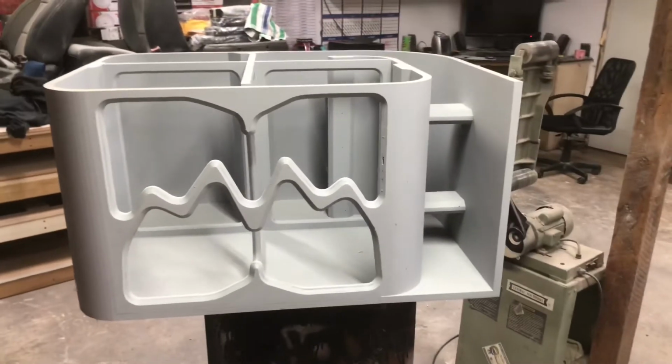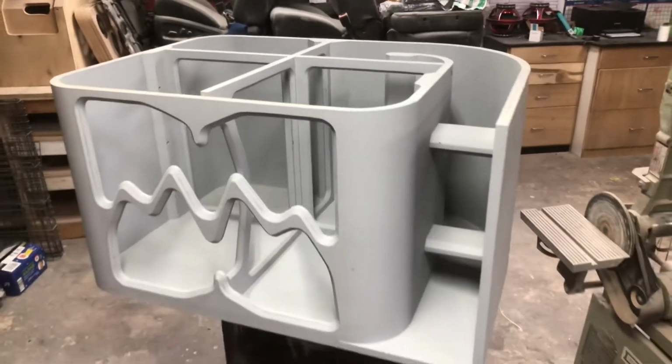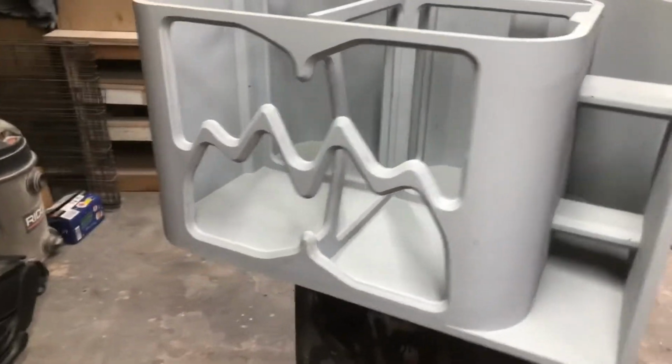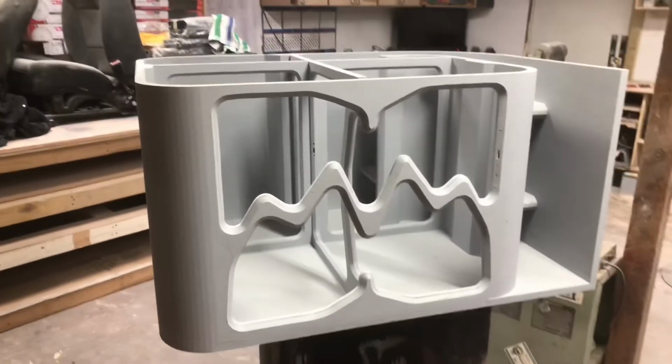So with that being said, we went with one layer all around the outside. Normally with woofers this big, it is a good idea to go two layers on the outside, but we kind of compensated with making sure we threw in a ton of extra bracing in this thing. See two braces in the port right there. That'll make sure those are nice and strong.